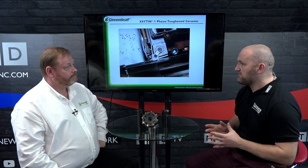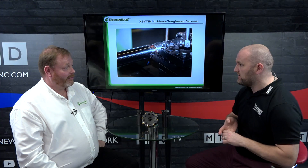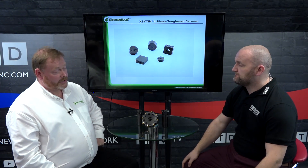I know you've got great heritage at Greenleaf in the mould and die sector, but presumably it's also all the other sectors — I know you're heavy in aerospace and difficult-to-machine materials, cast iron, stainless steels — so these apply to all those sectors? They apply to everything from your simple mild steels all the way through to your really difficult Inconels, thanks to the carbide and ceramic inserts.